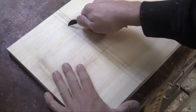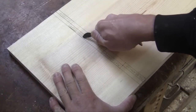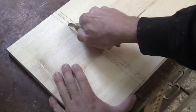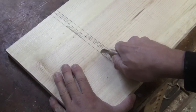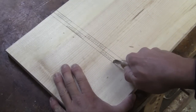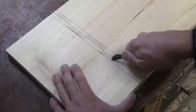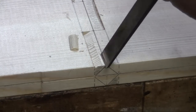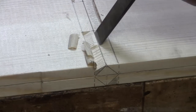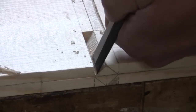The shaded area is what we will chisel out. I like to score the line with my chip carving knife. This makes a nice shoulder for my chisel to rest in. Now I just chisel down to that middle line. Do this for all those shaded areas.